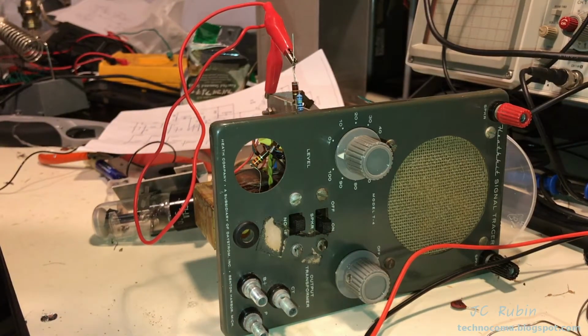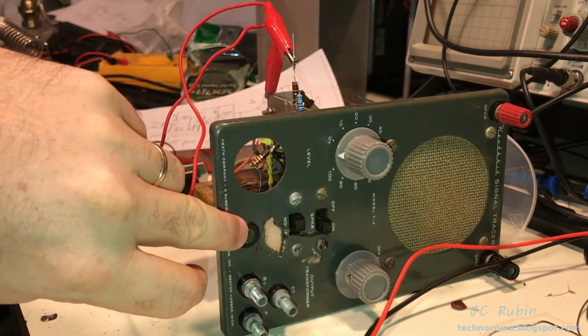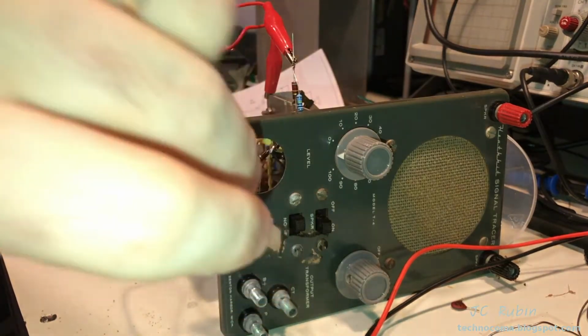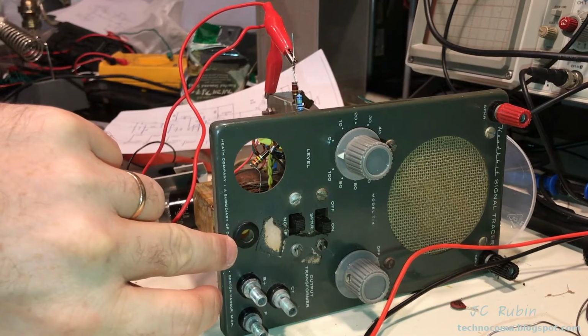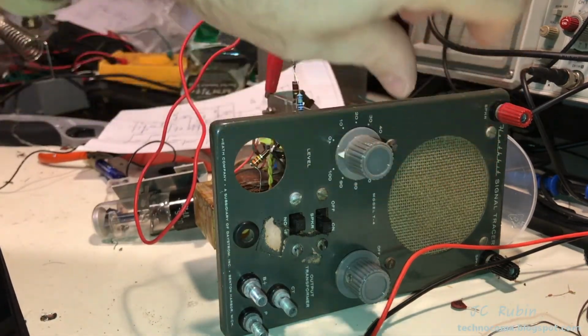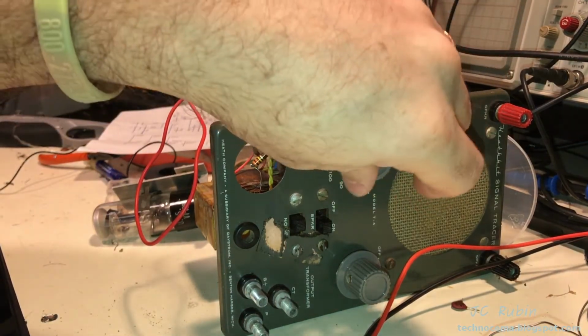It would be even better, in consideration, to use a connector that when the jack is unplugged, would short the input to ground, which would keep an amp like this quiet if the volume were turned up. You'd use a more expensive jack like that so you wouldn't blow out the speaker.